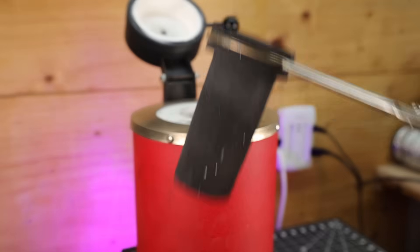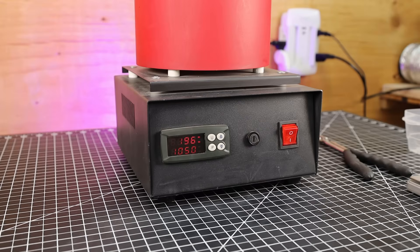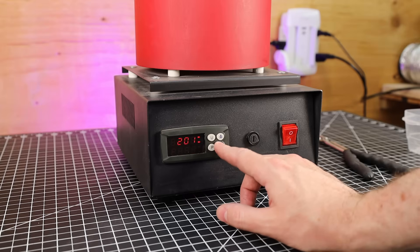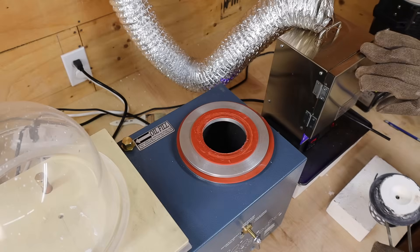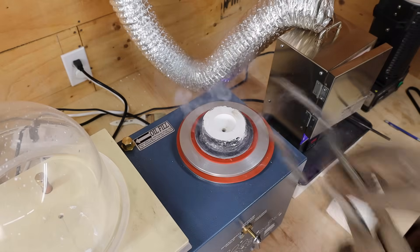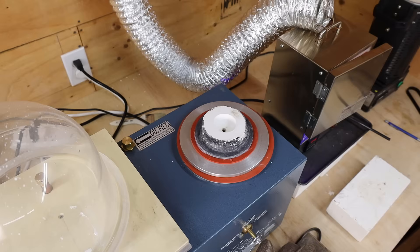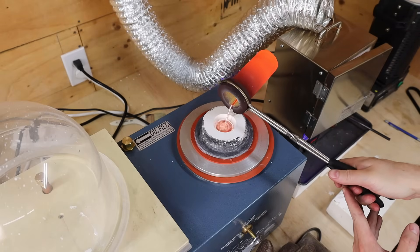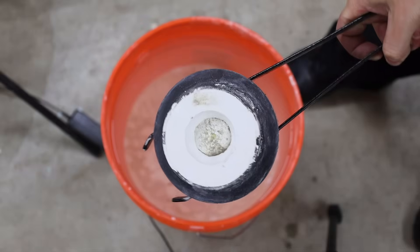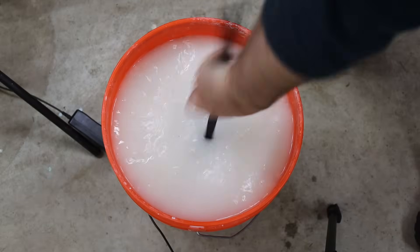When I have about an hour left on my burnout cycle, I need to start melting down my metals, and I'm using a furnace to do that. I load in my carbon crucible, pour in all the metal I measured out, close it up, and set my target temperature — which will be different for different metals, so I'll have a data sheet in the description. For the sterling silver I'm using, I'm setting this to 1020 degrees Celsius, or about 1870 degrees Fahrenheit. Now with everything up to temp, I can remove the flask from the kiln and put it into the vacuum casting machine. Make sure you have somewhere to set your flask down that won't catch fire, like the fire brick I use. Turn on the vacuum caster and switch it to the casting chamber. All the silver is melted to liquid, so it's ready to pour. The vacuum will pull the metal down into the mold, filling it out perfectly, and any air will get sucked through the porous plaster. Wait for the button to be solid and no longer glowing, then pick it up with tongs and dunk it into a bucket of water — make sure you completely submerge it, or it'll splash really hot water and investment everywhere. Keep doing this until it stops sizzling.